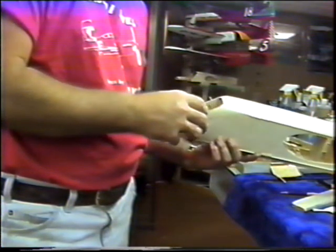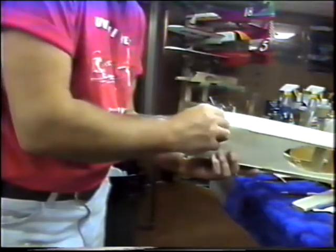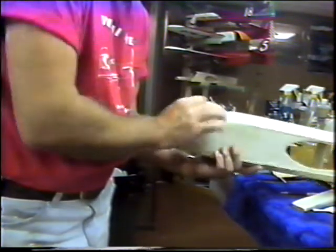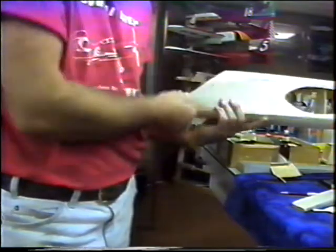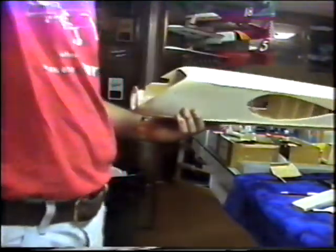Once you get these edges right, and we're closing in on having them right, they don't really change. You put dope fill or anything on here, it fills them up, you block sand it down. And I know those guys, they're judging the content, they're judging the appearance. First thing they look at, razor lines. Razor lines. They see some sloppy fit, back one row.